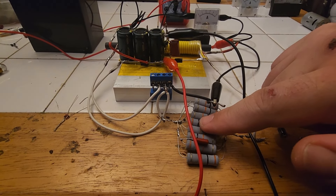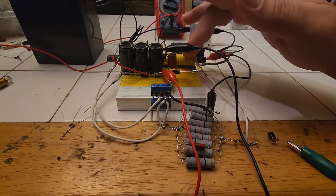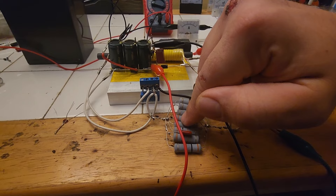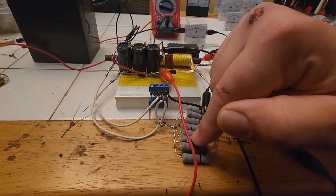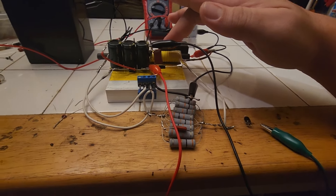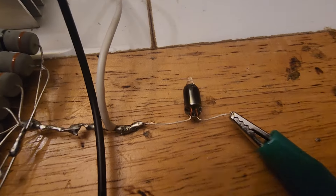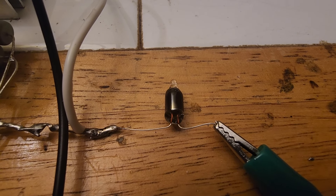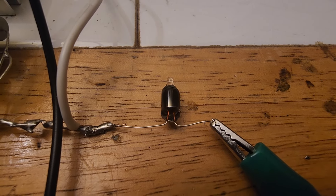This was an improvement — there are a bunch of 30k resistors, which was the harmonic frequency needed to keep this thing in resonance. It's a bunch of 30k five-watt carbon film resistors all in parallel to reduce the resistance, allowing increased current to flow through the circuit and more of the negative resistance effect to take hold. That effect is achieved by an earth ground connection passing through a cold cathode neon tube, a more advanced neon tube that is heavily emphasized for the cold cathode effect.